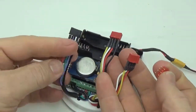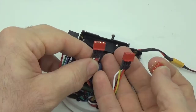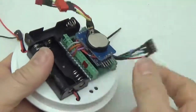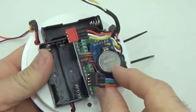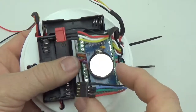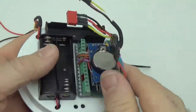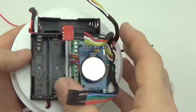logger. You've got two I2C sensors, and we're going to use different wires for those, which is a little unusual, but it makes sense in the context of what you're trying to build. But there could just as easily have been another whole set along this side of breakouts, and these are just for convenience of changing caps. These are screw terminals. You could just run raw wires into them, but I find that this just makes things easier to deal with in the field, especially when you have component replacements and sensor swaps.